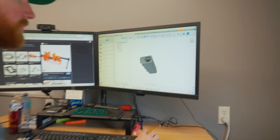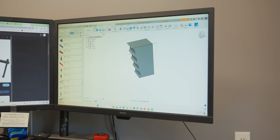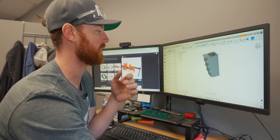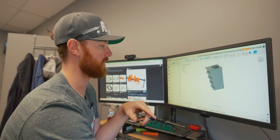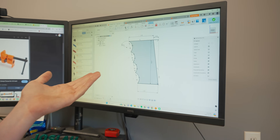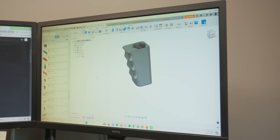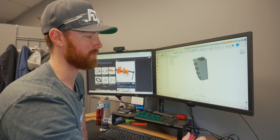I can play the timeline here and it shows you how the part would have been created. I'd be interested in knowing if you guys would want lessons on the actual design criteria — how to make a parametric model, where to draw, how to create everything. One simple point: people put fillets and radiuses inside of sketches, not realizing it's much more controllable to do that with the create and modify commands. Look at the sketch — everything is fully constrained and adjustable, so it doesn't matter what dimension I change, it's going to grow and expand without glitching out.